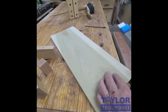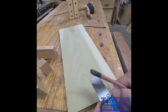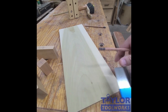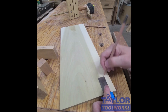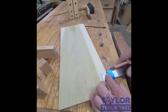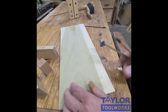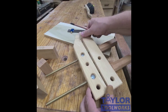You can also use this to set up drawer pulls or knobs. For example, I want to put a knob two inches from the bottom and one inch from the edge. I set one stop for each dimension, set the ruler down, and make both marks. I could do this for a whole kitchen with one device — no measuring, no worrying about inaccuracies.